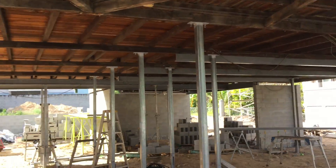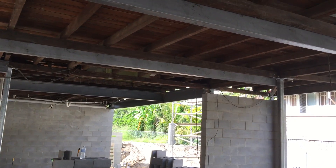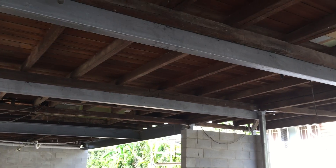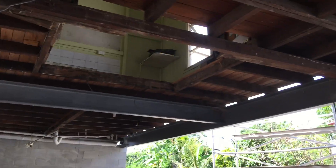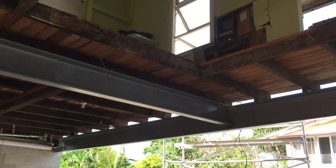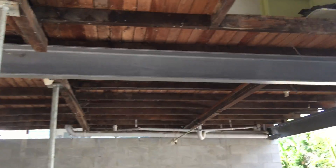There are things that should be done that most people today don't do. As you can see, we've already got quite a few beams up — I spent two days putting beams up so far. The hardest one took us half a day just to get it in, not so much because of fabricating it around the block wall, but because of the weight. That beam has a nearly 25mm sag in it, and it's a 300C channel only spanning 6.1 meters, which means there's quite a lot of weight up there. We just have to allow for the sag by pushing the bearer up to keep the floor straight.